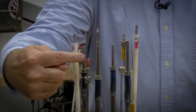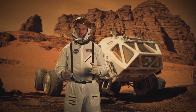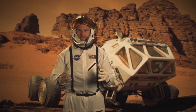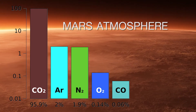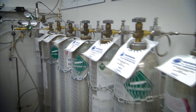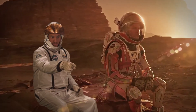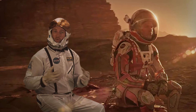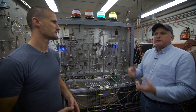This line here is the waste gases left over from the catalyst process. To test this technology, you're going to need some Martian atmosphere — where on Earth are you going to find that? We know the composition of Martian atmosphere: it's 95% CO2 with some trace gases, and there are companies here on Earth that will mix that gas for us. We call it Mars mixed gas and we use it for most of our testing. What if we land on top of a mountain or down in a valley? The conditions for extracting oxygen are totally different — we've got to test for all of that. So we design an instrumentation system that covers all conditions: lower pressures, higher pressures, clogging filters, oxygen purity, all of that stuff.